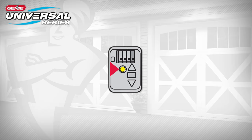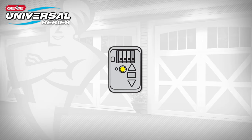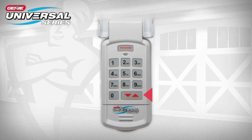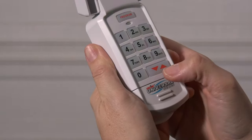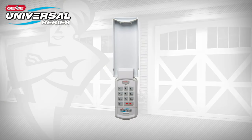On the opener, press the Learn Program button for 2 to 3 seconds and then release. On the keypad, press and release the up-down key once. The opener will click. On the opener, again press the Learn Program button for 2 to 3 seconds and then release. On the keypad, again press and release the up-down key once. The opener will click again. Press and release the up-down key again, and the opener should move. Programming of opener 2 or 3 is complete.